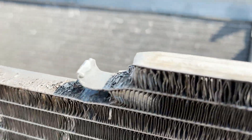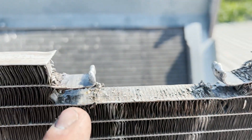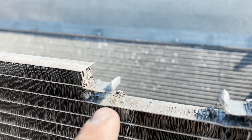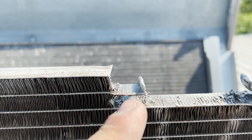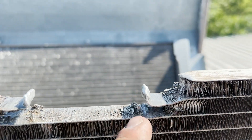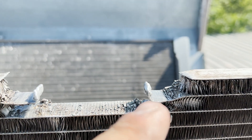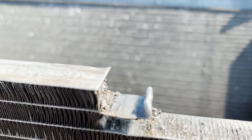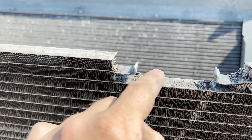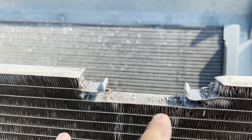Many tries later and we are finally there. This is very different than the braze rod. The most important thing I learned: the instant that rod is liquid, you need to get the torch off of it. You can't feather this out — you can't do any of that jazz. You've got to get it on and get the heat off of there as soon as possible. It took a couple tries. My fix that was all the way along the side was not having it, so we had to go to these two turn ends.